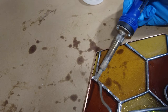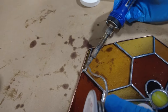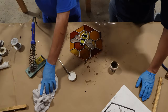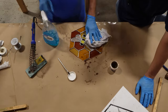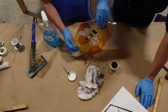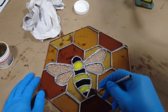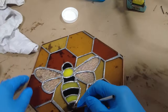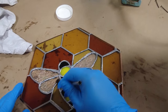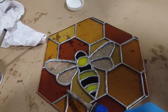Carlos has another nice beginner tip where you can place little droplets of solder along the run so you don't have to worry about feeding the iron with the solder at the same time that you're running the bead. Carlos likes to clean as you go, removing pretty much all the old flux on the first side before starting again on the other side. I'll admit it does look like I am going a little bit overboard with the flux, but I do like to get into the groove of soldering and keep going to make a lot of progress. But again, it might just end up causing a little bit of a problem when I have to go back and reapply.